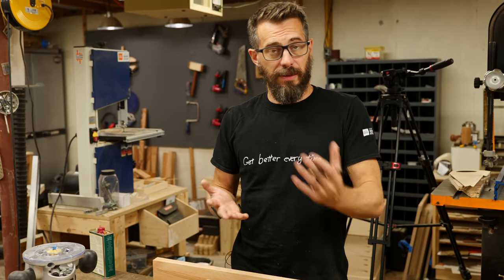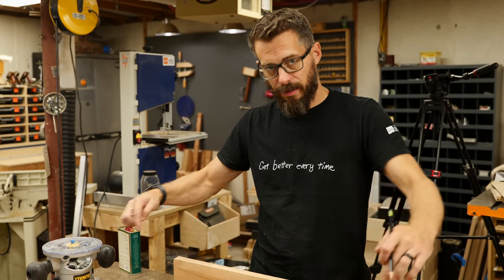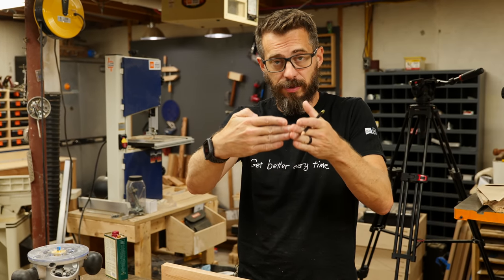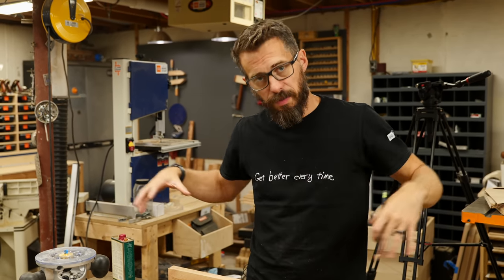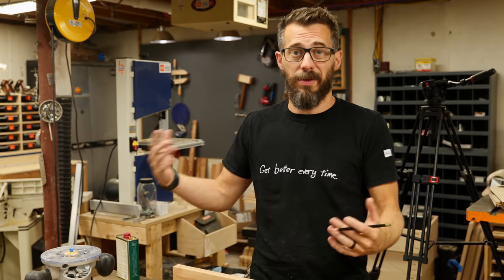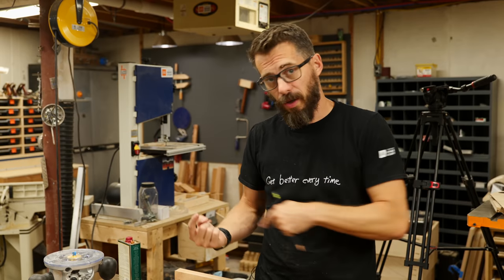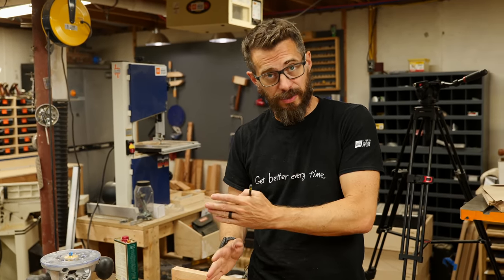So one of the important things that I'm learning here about dovetails is that you need to make sure that you have your pieces laid out in your box in the correct orientation, meaning that they're overlapped correctly like they're supposed to end up, and that you number all of those corners, all of the joints between each piece, to make sure that you get them in the right order. You also want to make sure that you have all of the upper faces marked all the way around so that when you put them in the jig, they're all facing the right direction.